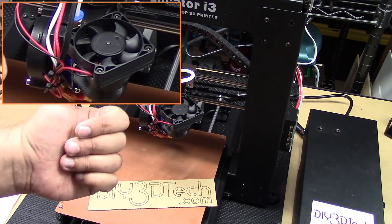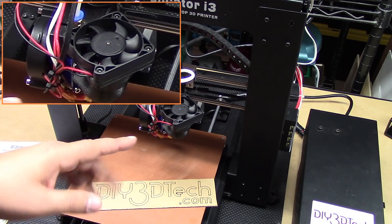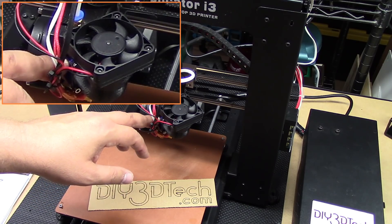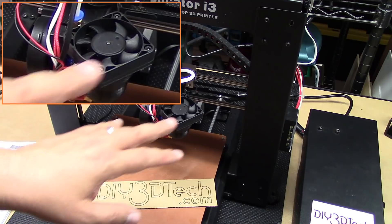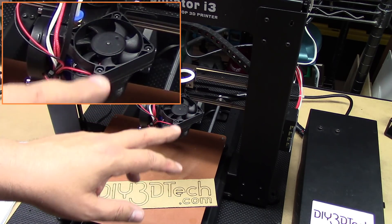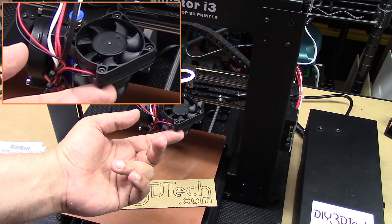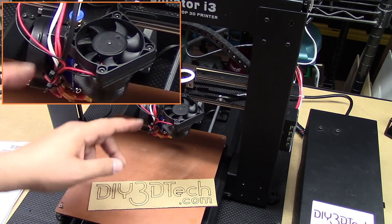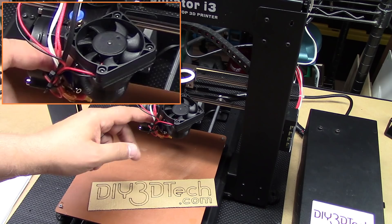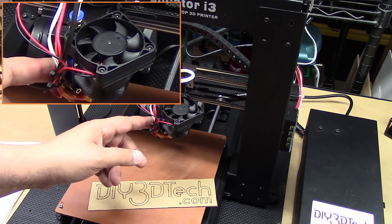All in all, I think it's pretty good. I'll have the link to this out on Thingiverse — if you have a typical E3D hot end and want to do this modification to go with a 50 millimeter fan, it'll be out there. I just used M3 screws, about seven millimeters long, and they tapped right into the ABS plastic. Then I used some number four self-tapping screws to go into the mount. I went with four and four just for looks — you could go two and two, it's not that heavy.